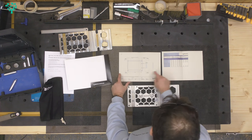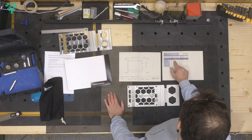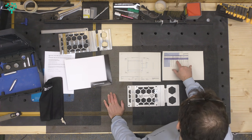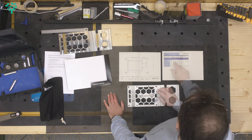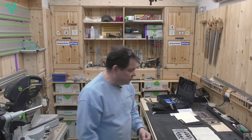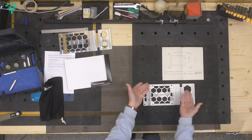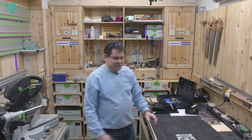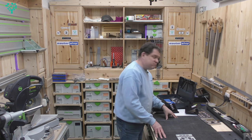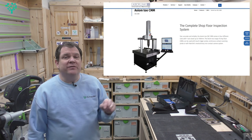Your rail square comes with a whole series of calibrated measurements. The report gives different areas: measurement number one, two, three, four going around the square, with nominal measurements, upper and lower error limits - allowing for plus or minus 0.2 degrees tolerance. The error on mine is 0.001 degrees, so it's passed. I asked Ralph what happens if one fails - he said 'I don't ship it, I make a new one.' The calibration is locked to this specific device and order number. The machine he uses is the Aberlink CMM, measuring to a tolerance of two microns.